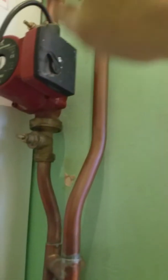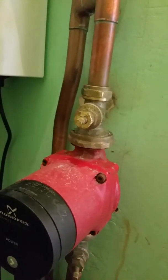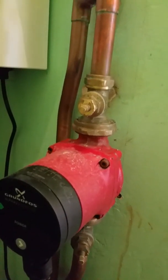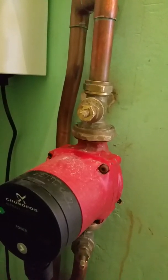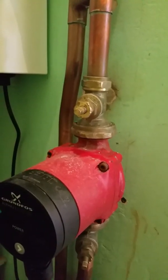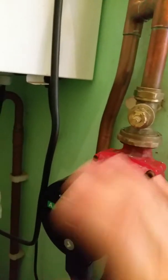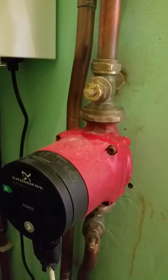This pump is literally driving the heat exchanger down to this point, then this pump picks up the duty. My resistance in the system is probably around two to two and a half meters head — I haven't done a full calculation, I just knew it wasn't going to be more than five meters. Sometimes we just take a punt on these things, and I had the pump anyway, so we popped it in.